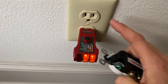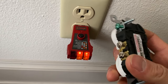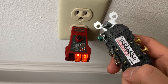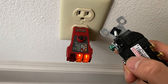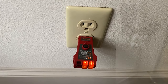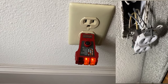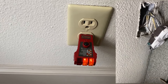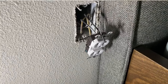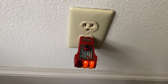These old outlets in older homes don't have side screw terminals — they just push the wire into holes and it becomes loose. As you can see in the video I'm attaching, the neutral wire basically burnt out and came out of the outlet, and it was not letting power go through to the rest of the outlets.